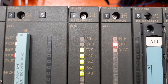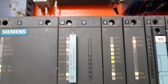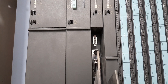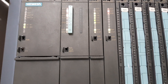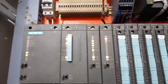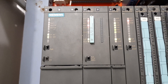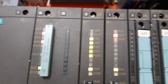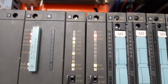Next up is CP443 — this is the communication processor. The purpose of the communication processor is to take the Ethernet connection from this rack to the Scalance switch. This communication processor carries all data from the input/output cards to the Scalance switch, which subsequently takes the data into the DCS network — to the HMIs, operator stations, and other PLCs as required.